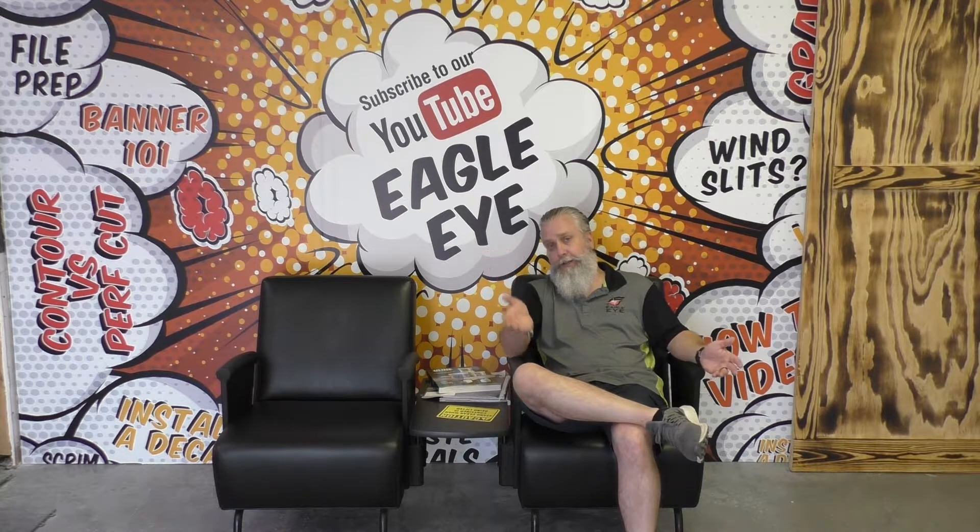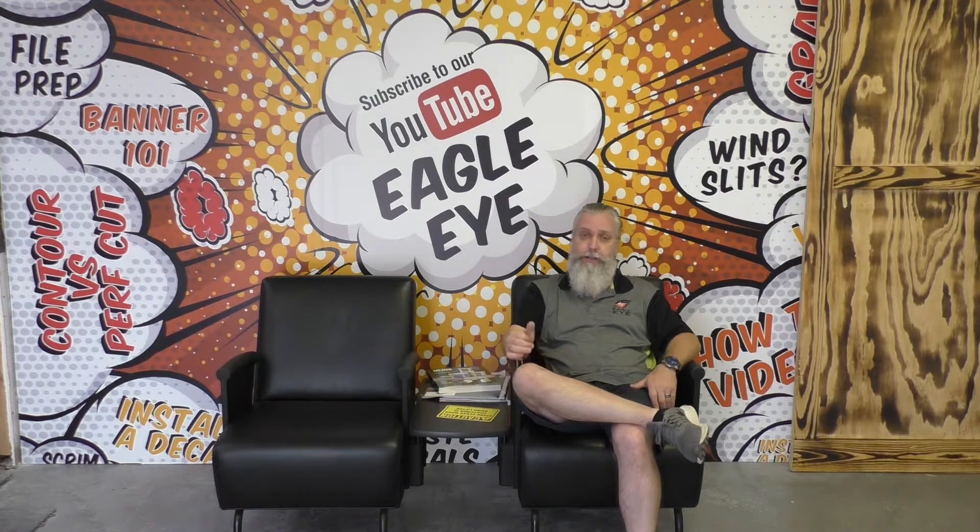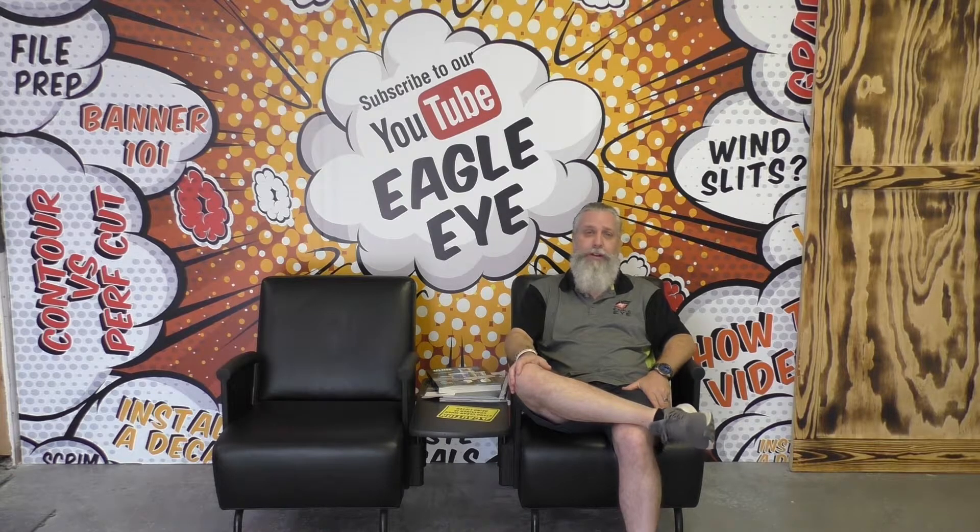If you've watched any of my videos here at Eagle Eye, you would know that we use a lot of low energy film for wall wraps. I think it's the best product out there — it doesn't curl at the top, it doesn't curl at the bottom. And because I had one of my designers create a really busy, crazy background, like I said before, I just sheetrocked this wall. I didn't mud over my nail holes, I didn't even tape the seams, because the material is thick enough, and unless you really stare at the wall, you can't find the holes in the seams.